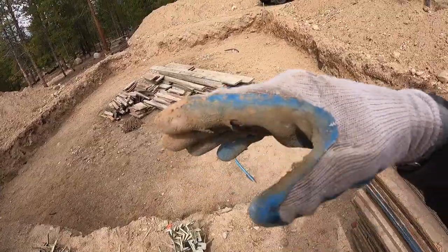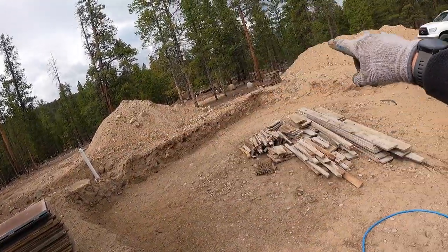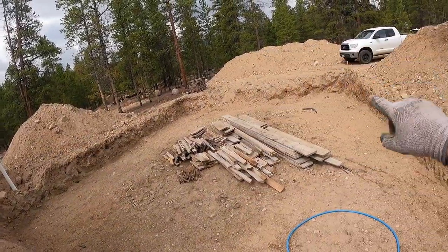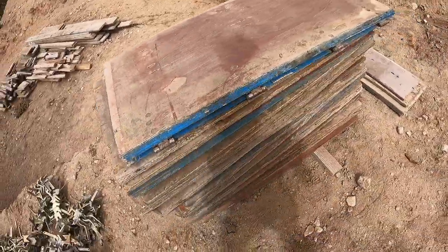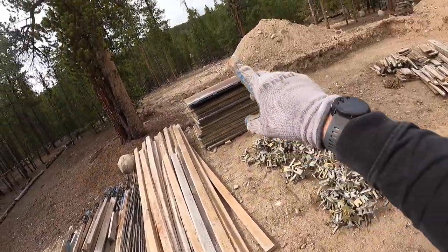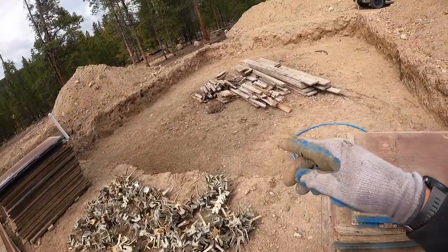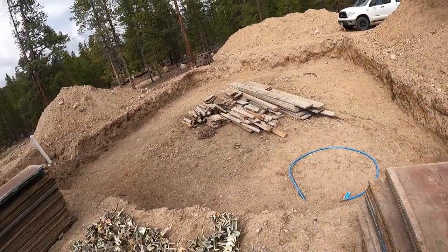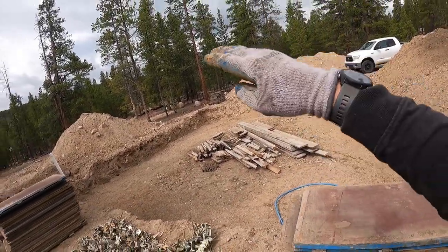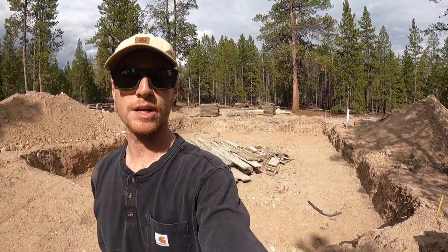We're gonna be forming 30 by 24 and just putting in piers, 9 piers for the deck and porch part. Got all our concrete stuff over here. You guys have seen a little bit of the septic system. We're ready to start forming these footers so we can pour our footers and then form and pour our 48 inch walls, 4 foot crawl space, cabin on top, cabin kit. We like that foundation, like a 2 foot overdig on both sides, plenty of room.